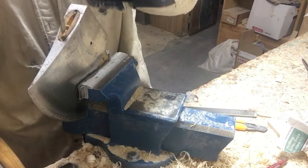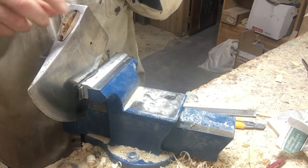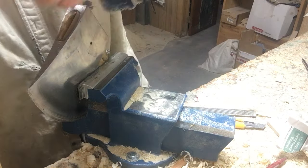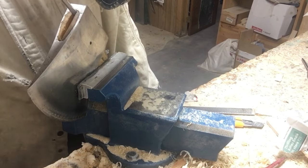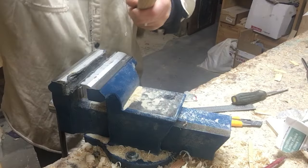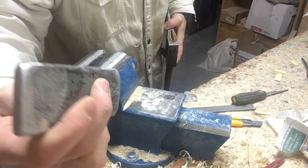Once it gives a little bit you're all set. I used a hickory wedge in that and it was a little bit tighter — you could tell by how the drill was screeching coming out. There may be a little bit left up here, so just make sure you get that out too and loosen it. Now that it's out and still fairly tight on there, all we need to do is get our axe drift — it's just a chunk of metal about half-inch wide and about an inch and three-quarters long — set it on the eye and give it a tap with the hammer.